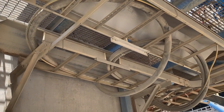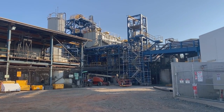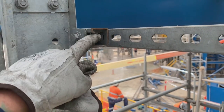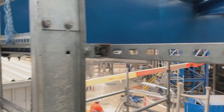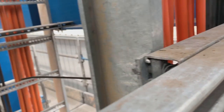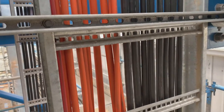This is something I've never seen before. They really desperately wanted to put a service loop on this cable and it was huge, so they put in another bit of tray, notched out the sides, and just ran it around. A bit of Unistrut goes from side to side, and they bolt a bit of Unistrut to the bit of Unistrut so they can use the Zebedee clamp. Why not just have this facing the other way? It's only clamped on, so it's easily movable. They've done it all the way along here. It's a waste — a waste of fittings, a waste of Unistrut, a waste of everything. I mean, who uses Unistrut anyway? Could've used a bit of angle, make it a bit more strong.